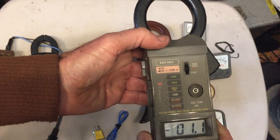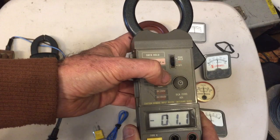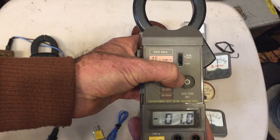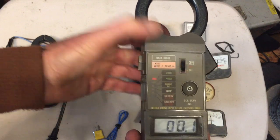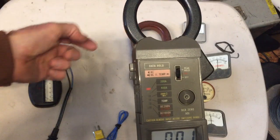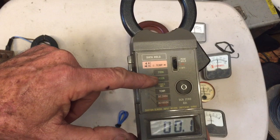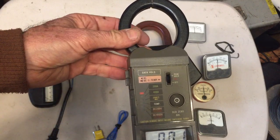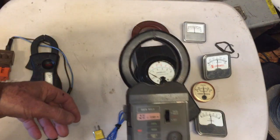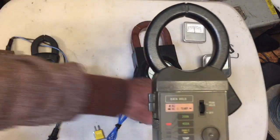It's not the most accurate meter I've ever had, I will say that. But what I like about it is I can measure anything from about a half amp on up — maybe even a little more sensitive than that. All I've got to do is put my wire right through here and I get a reading. This one goes up to 400 amps. One of the problems I've had with it, however, is that sometimes if you put this thing near anything that's got a little magnetism, you get a reading, because this thing is sensing the magnetic field.